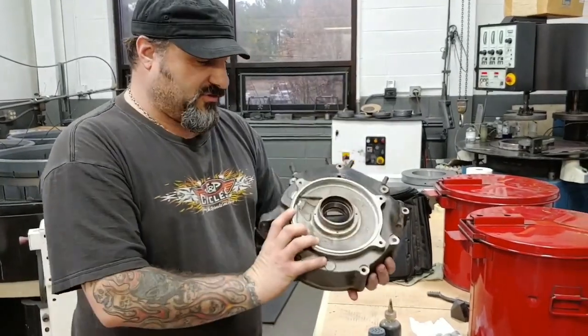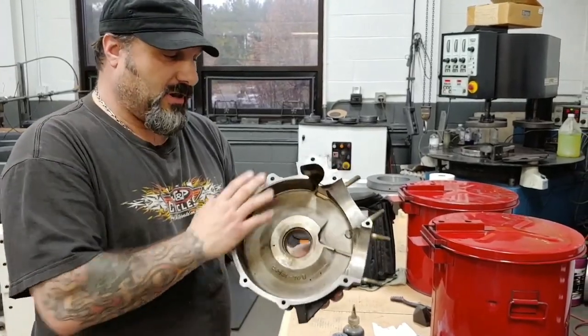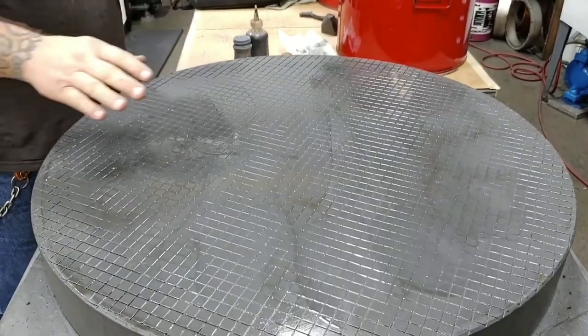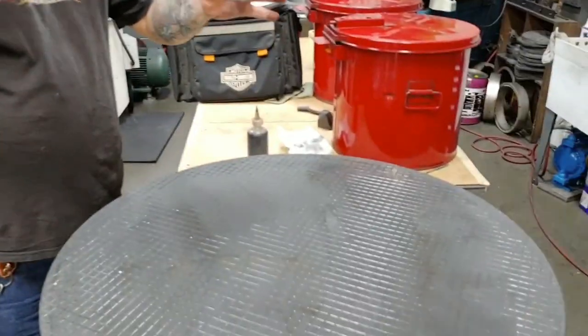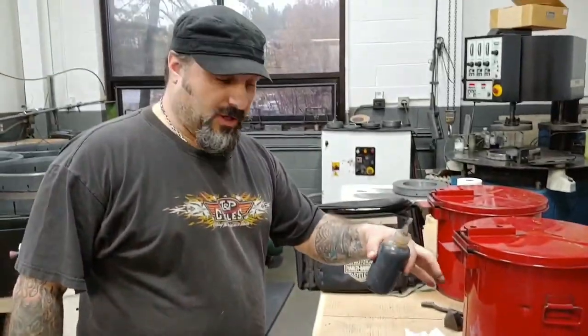What I'm doing now is I'm going to shovel it into the case — I had to do machining for the alternator O-ring. I'm going to lap the bottom surface here. This is a lapping plate. This lapping plate is flat within one tenth. We sprinkle this with 500 grit silicon carbide and this is just lapping oil.